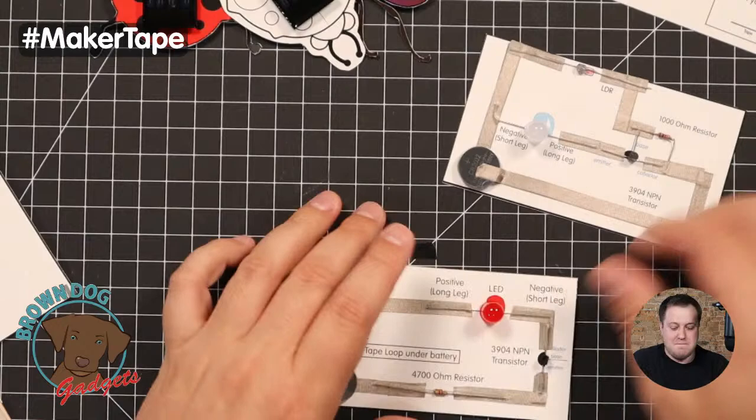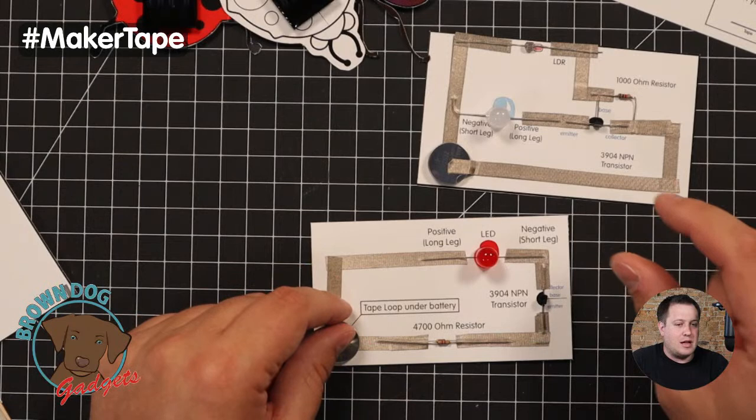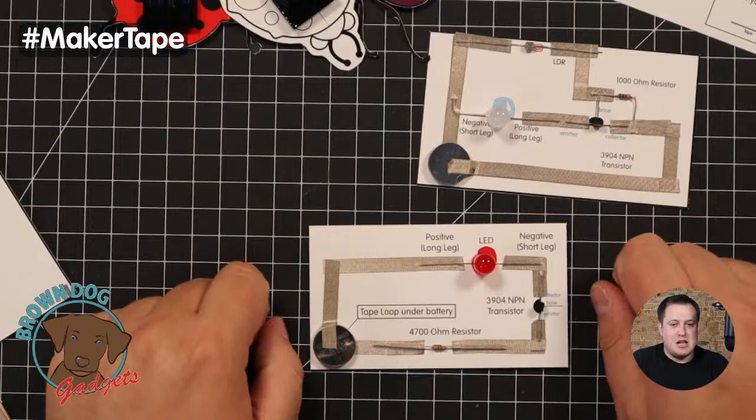They have those little solar dancing flowers, which are really fun to look at because it's a fixed magnet and a coil of wire, a transistor, a capacitor, and a tiny calculator solar cell, just a small amount of energy. Not even a milliamp, it's less than a milliamp. It just fills up, and when it hits a certain point, the transistor kicks the power through, the coil makes a magnetic field and pushes away, and that's how you get the dancing flower. It's so simple.